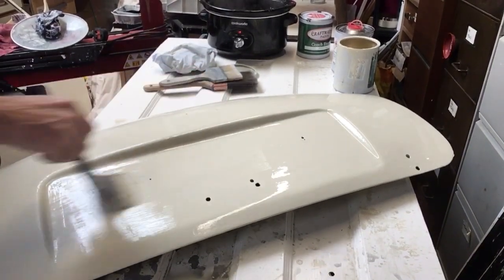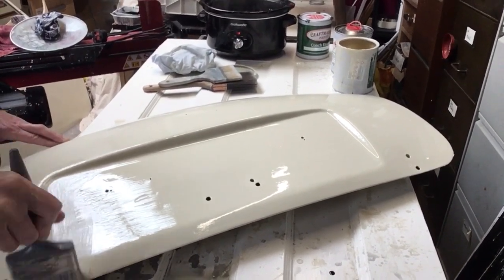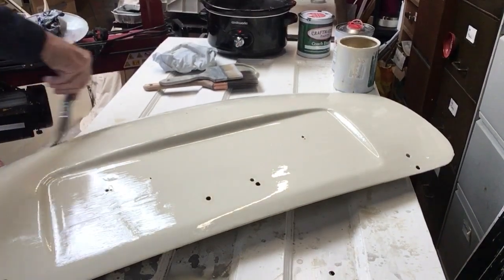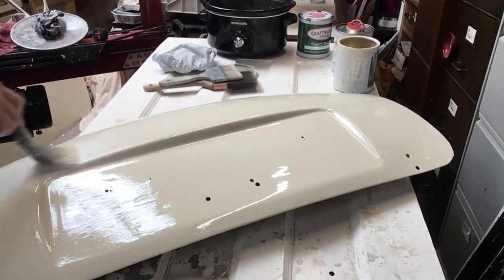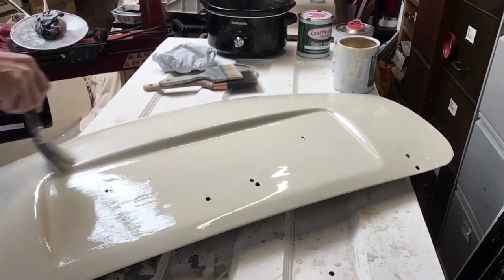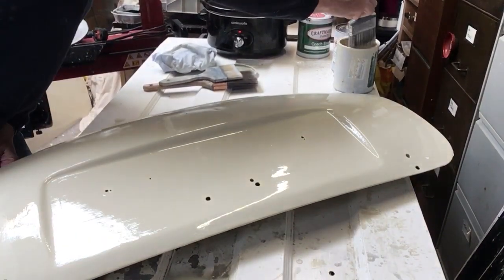All you do is go across like that, making sure you cover all the nooks and crannies. It doesn't matter if you wrap it on like that and then smooth it off afterwards — just don't whack it on because you'll have brush marks all over the place. You've got to feather it across — that's the trick. Then leave it alone. If you see a run on it after you've finished, don't touch it, because it forms a skin very, very quickly and if you do you'll smudge it and make a right mess.